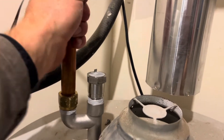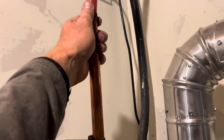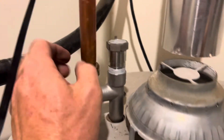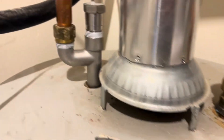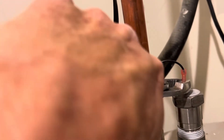I'm hand-threading the hot water line back on here. Some people in the comments will say you're never supposed to reuse these joints — I really don't believe that. If you're concerned, you can cut it off and put a new copper piece in with a compression nut, but thread tape and thread dope on there, tighten it down, you're going to be fine. Once the connections are on, take a pair of pliers and just crimp the positive lead down a little on the anode for a tight connection.